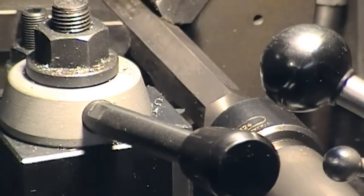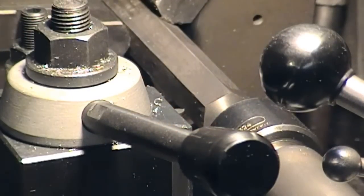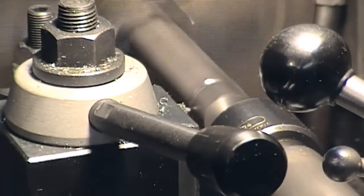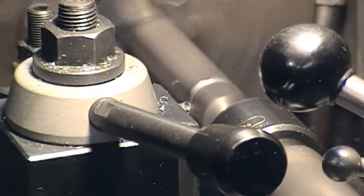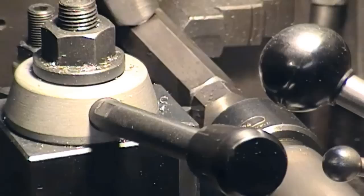As I'm only making one nut at the moment, I'm going to nominally come back about a half inch. But before I do anything else I'm going to get rid of the hex and make it easier for parting off, plus it'll give me some chamfer at that point. This is only a round nose tool, I'm not too concerned with details, other than just getting a little bit of chamfer. I'm traversing slightly here, not worried about finer points, just going to get this little bit of extra depth.